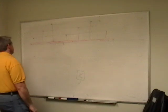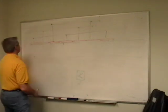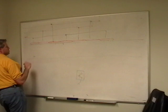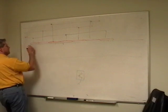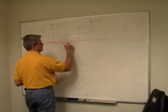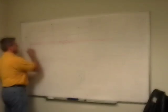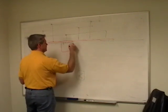Well, if this is slightly P plus, and I put a positive voltage here, a big positive voltage here. It can work the other way, of course. We're going to get this field underneath here and here, like we talked about with a regular transistor, right? I'm going to expand this and make it look big. I'm going to get this potential well that forms under here.